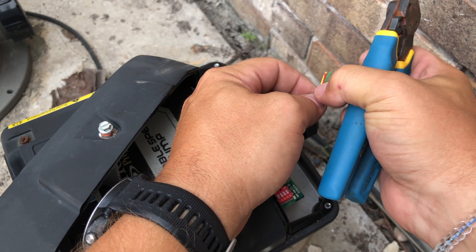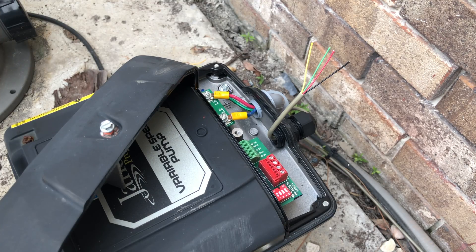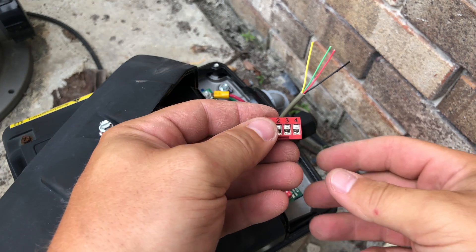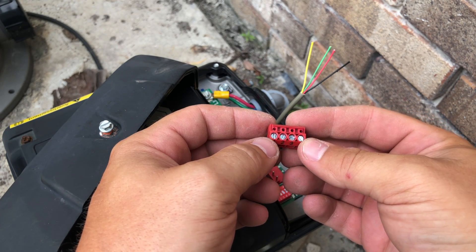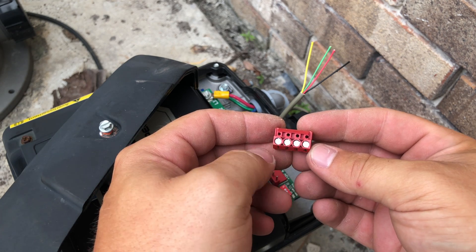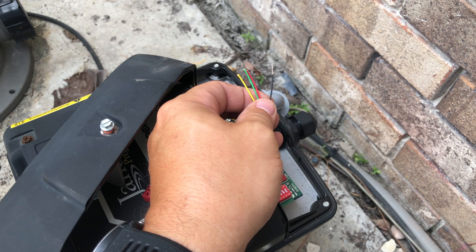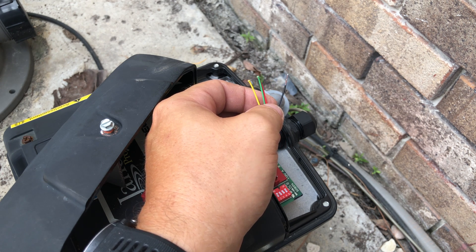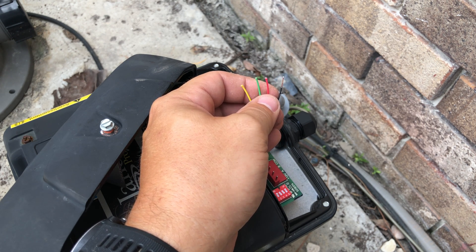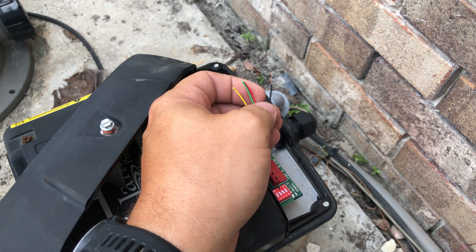You can see we got a red, black, yellow, and green wire. We're hooking up the comm wire to this red plug here — go ahead and pull that out. There's a certain way you have to put the color wires in certain terminals. From left to right, we do red, black, yellow, green. There's an acronym I like to use to help remember this: 'Real Big Yellow Gorillas.' Strip the wires back — you really only need about a quarter inch of wire exposed. You don't want too much exposed so the wires don't touch, and make sure you don't have insulation underneath the connection.